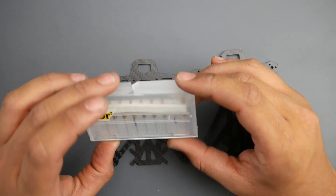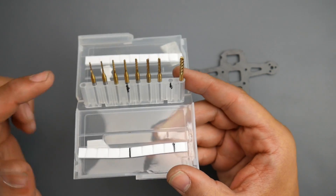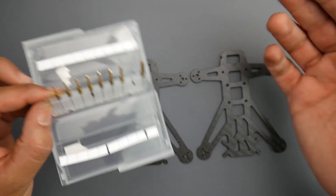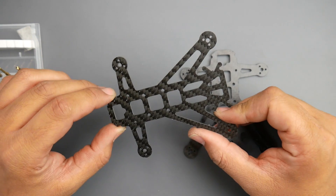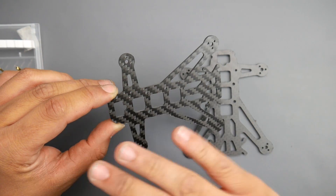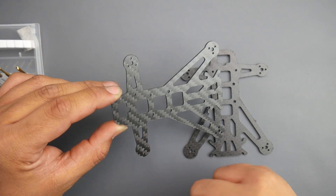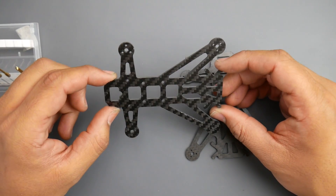Here are the results. A couple things I figured out with these end bits: we either need to go slower or give more RPM. I broke one during the tool change — that's something very common. The ones that didn't break are still not dull. The first frame ran at 10,000 RPM and 300 millimeter per minute feed rate, with 100 millimeters per minute plunge. The top side came out pretty good, though the carbon fiber got some white marks — possibly from resin or air bubbles.